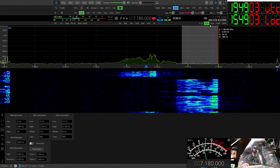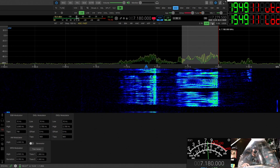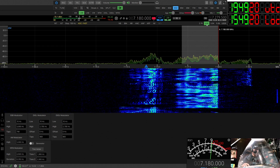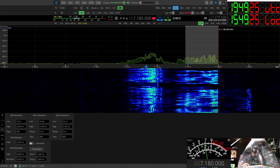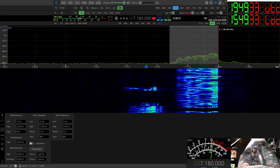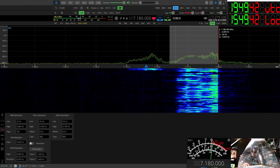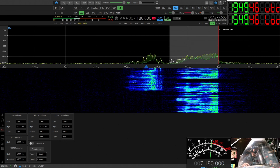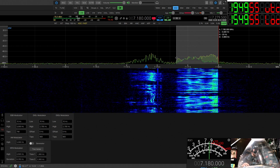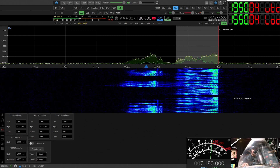Let's do one more time. I'm still recording as I speak. AC10 from W3ZG — I'm actually surprised it's at this setting; it's wide enough for quality AM. To get to 4k wide I sometimes have to turn the radio off, hold two buttons down, then turn it on and it automatically shifts to 4k. But if I want to run at the 350 to 3050 I'm currently using and go to 4k wide, I actually have to turn the radio on and off. Back to you, AC10, from W3ZG.